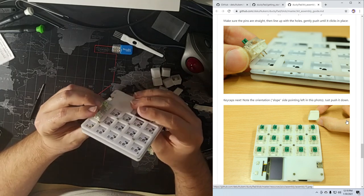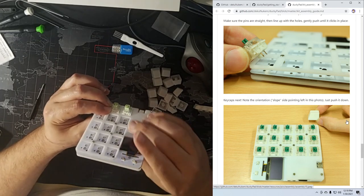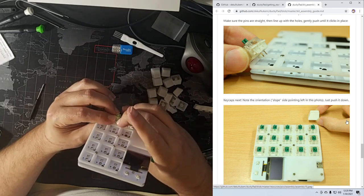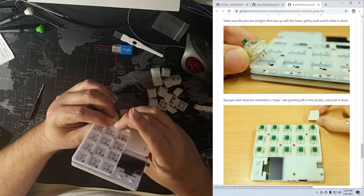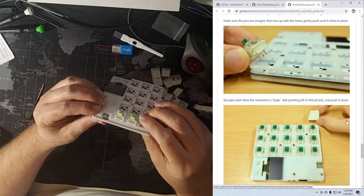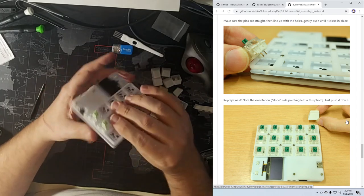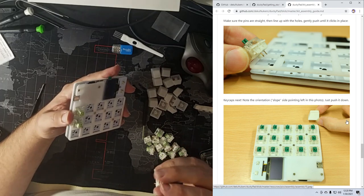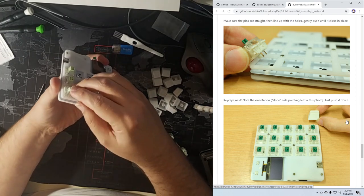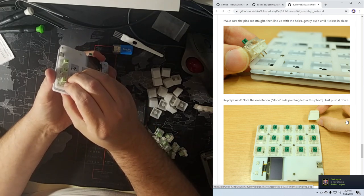It doesn't quite look like the standoffs are the right size to suit the plate thickness and the switch height. I don't know, maybe box switches are a little off dimensionally from what a regular MX looks like, but I'm getting some bending here on the plate whenever I insert the switches all the way. I don't know if that's coming through on the camera. I'm not going to worry about it. I think there's enough pin length here that they're getting good engagement even without being firmly seated against the PCB. So it shouldn't impede functionality at all. Just a sort of aesthetic thing.